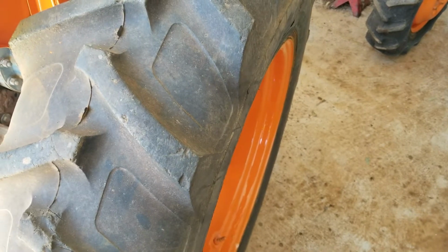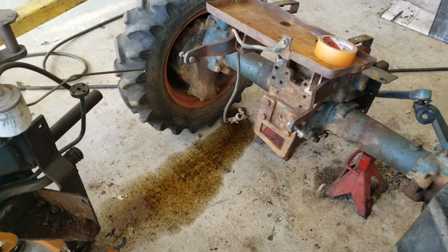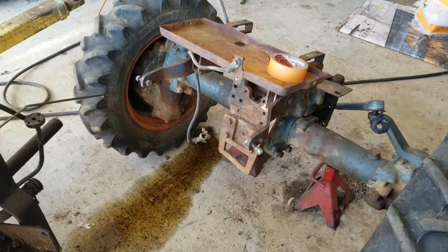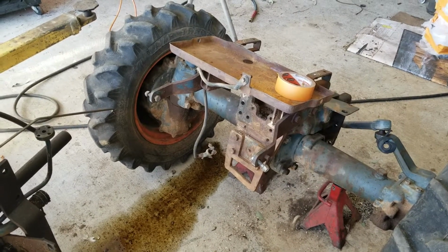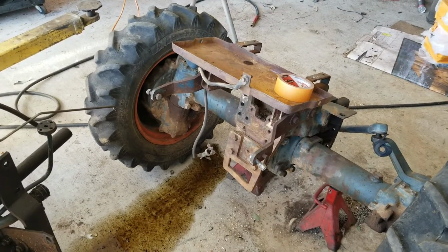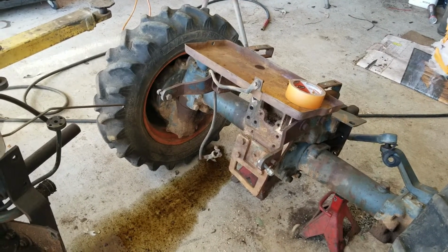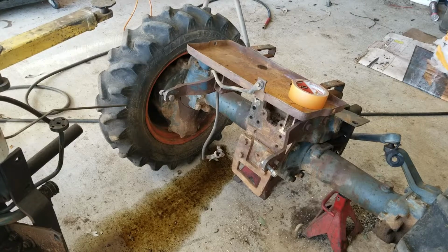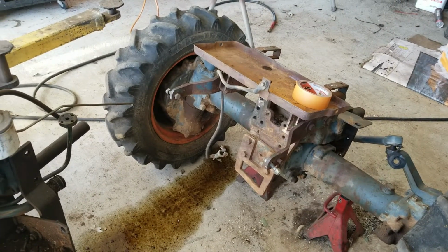But yeah, what happened to this tractor is the typical L295 DT. They like to snap the oil pan. I welded it up once, but ran it out of oil probably one time before that because it leaked out. As soon as you put it in four-wheel drive and you move forward a little bit, it just ran out of the oil pan faster than you could do anything. It ran out of oil, and dry seized once, but it didn't seem to hurt the motor.